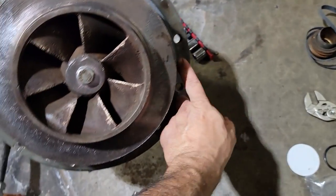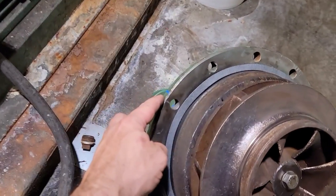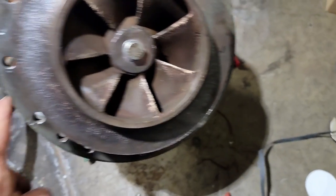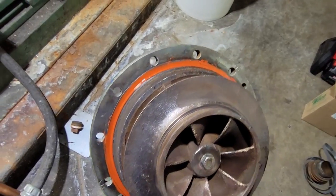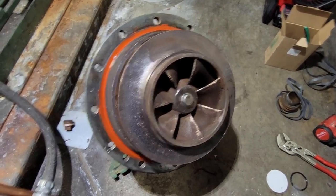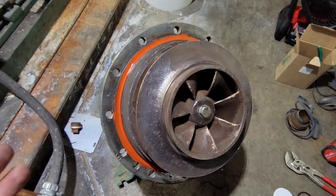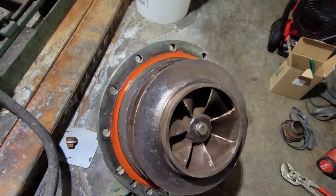Just got to add that little silicone behind it and on top of it, then we'll start matching it back up over there. I've already put blue marks in different spots to help make it easier. I've got a very thin little layer all the way around there and I'll put a little layer on top of that so it mates against the housing. I've had to do plumbing at different companies. Sometimes you'll even use silicone with rubber o-ring on your basket strainers, and a lot of times it holds a lot better than plumber's putty does.